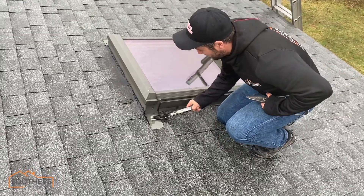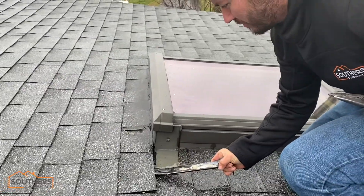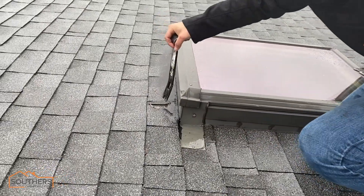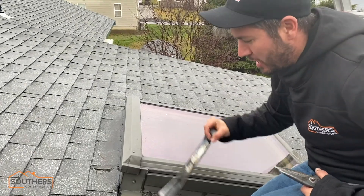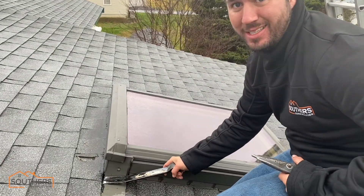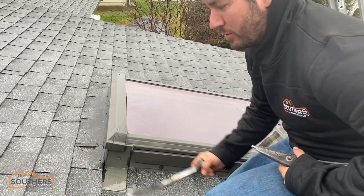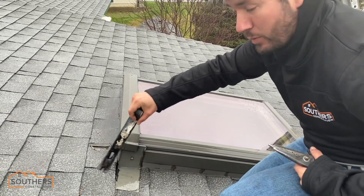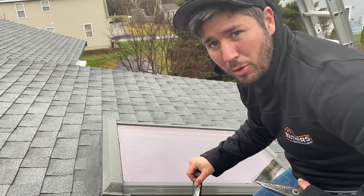There's this water flowing out — just by breaking that caulking seal, you can see all this water that's flowing out. All that water is trapped behind there because of this puddle. When it has nowhere to go, water is going to take the path of least resistance. When it's blockaded like that, especially when it's thick — probably a half-inch thick there — it's going to go left and right and travel in other ways, and it's an issue. So we're going to cut it out and get the water a nice, easy path to flow, and no more leaks. Let's go.